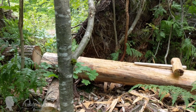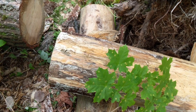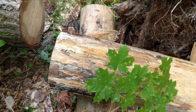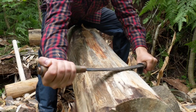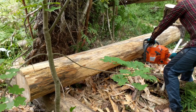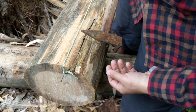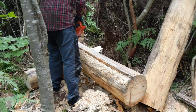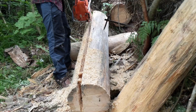As I tried to lift it, I realized I wouldn't be able to carry it by myself without using an A-frame block system that I used to skid large logs for my cabin construction. Using it for transporting this log would take a whole day because I am so far from the camp. So I decided to make my workbench shorter and to shape it as much as possible on this spot to get rid of extra weight. I lost this hammer around here a couple of years ago — I used my old friend for securing a marking rope. Now I can make a straight cut using a freehand swinging technique to rough shape the bench's top surface. I've shown this milling technique in detail in the video 'Two Chainsaw Secrets' — I will provide a link to it below.